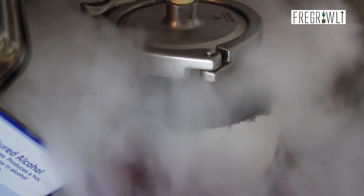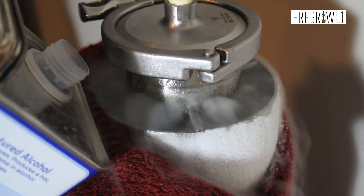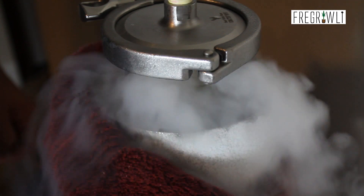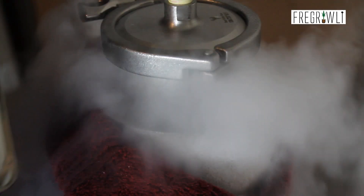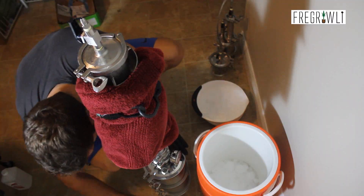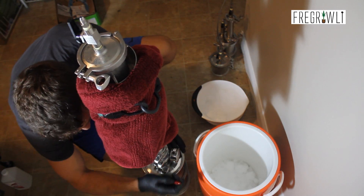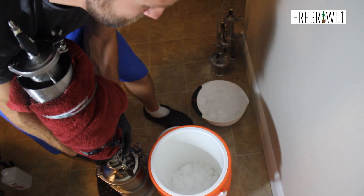You have seen it on my Instagram feed, and we've talked about it quite a bit here already in this series and on my channel, but this is one of the most exciting upgrades for me. A de-wax sleeve refers to the outer cylindrical portion of the materials column with a larger diameter and open top but closed bottom. This allows you to fill the sleeve with a combination of dry ice and denatured alcohol to achieve temperatures as low as, and even lower than, negative 50 degrees Fahrenheit, according to my laser thermometer.